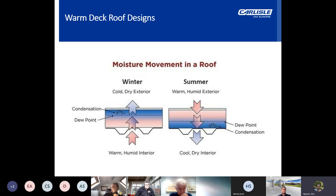Why is this important? Well, once a warm roof is completed, it's effectively a sealed capsule. Now, when the sun shines, the air inside the capsule expands, which may cause the membrane to balloon. When the roof cools, the air contracts. If, when the temperature rises, the air expands and escapes out of a defective VCL, there will be a negative pressure caused within the layers when the roof cools. This will mean that the air from the building is drawn back in through the defective VCL layer.